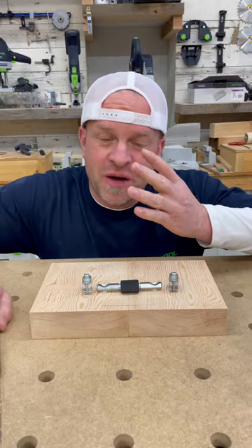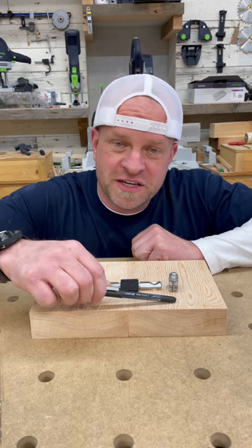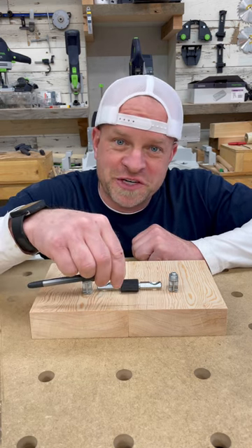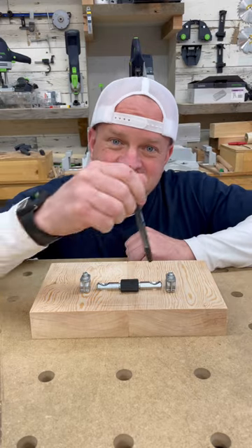And then we're going to make four cuts with the domino. The first two are for the center bolt — one will go 50 millimeters into the board this way and one will go 50 millimeters into the board that way. And then the next two are for these anchor bolts and they're going to be drilled down from the top.